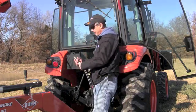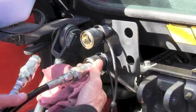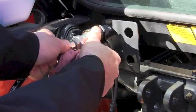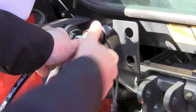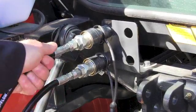Then I'm going to plug these two hydraulic valves into these remote holes. A lot of times you have to push forward on these sleeves, then push the remote valve in, and then let them come back — and you're hooked up.